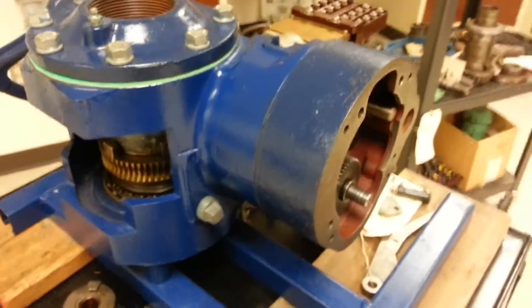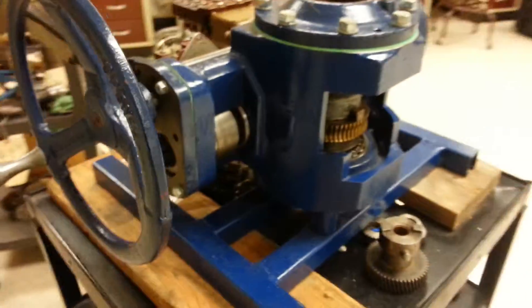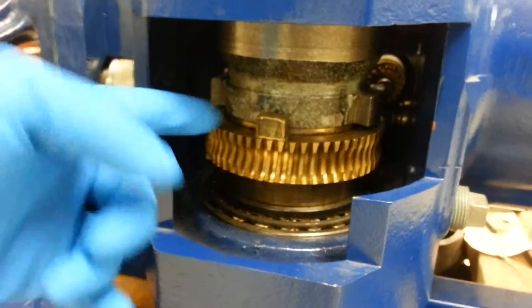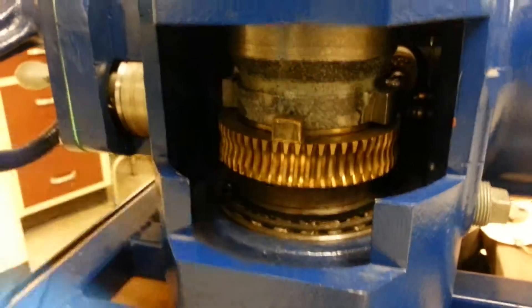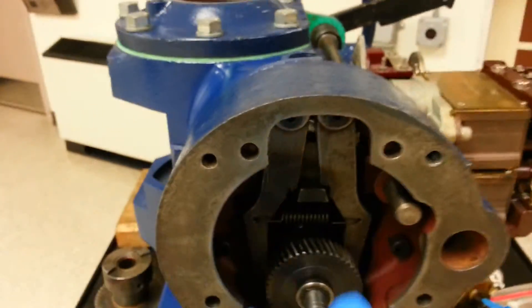What we have here is an SMB0, and you can see it's a cutaway — an excellent example of the worm gear. It's a lost motion worm gear, showing how the lugs come around and strike the worm gear on the other side, and shows the worm shaft gear.